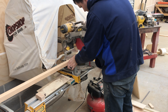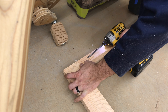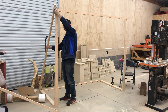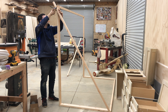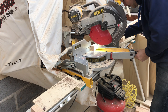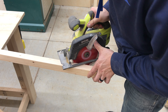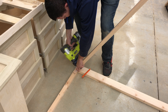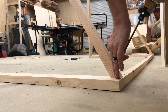Now we measure and cut the piece for the back on the bottom. Since we used a full 2x4 on the top and these were three-and-a-quarter inches wide, I took six-and-a-half inches off and stuck it in between the two with two pocket holes in each. I spent a few minutes contemplating a compound miter but decided to just clamp it, draw a line, and do regular cuts — compound would look cooler but it was getting complicated. I use my circular saw since it was a bit steep for the table saw, then attach it with a couple brads first so it doesn't slide, then come back with screws on the top and bottom to secure it.